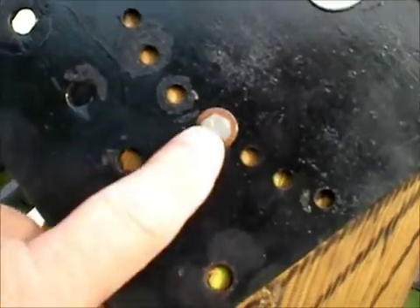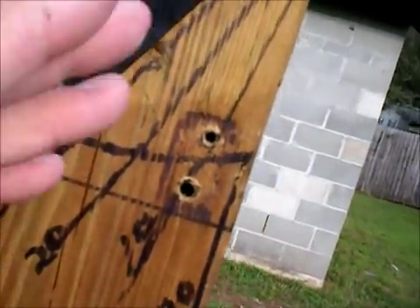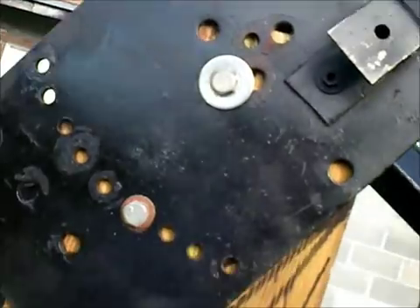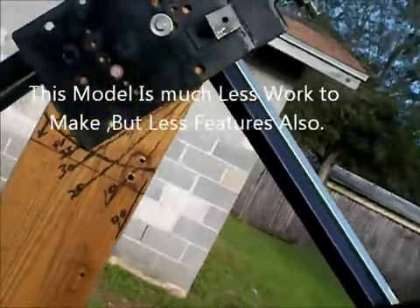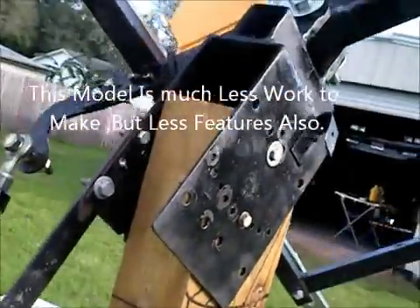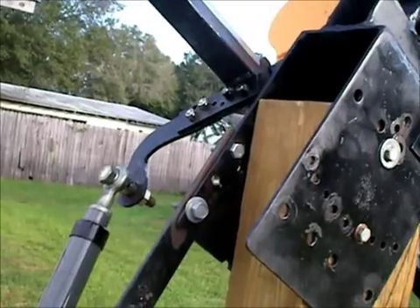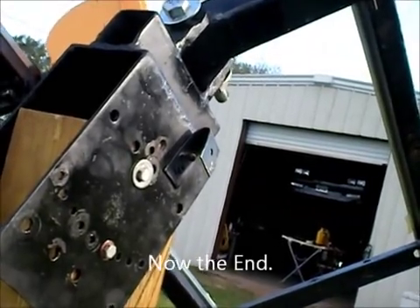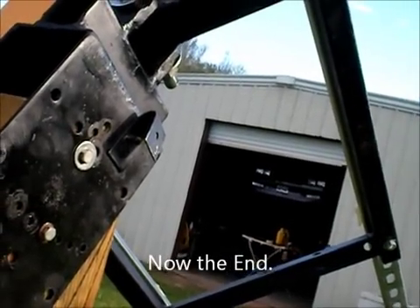To adjust the inclination you take these bolts out. I started playing around with putting lines in — 30 degrees, 20 degrees, 15, 0, and so on — for your seasonal inclination changes. I'm glad I didn't just stick this in a garage and forget about it, because I think I'm going to make a new and improved version, a bit wider on the pivot. It's a very easy way to get someone tracking their solar panels — at least three to six hundred watts of panels. This would do easily, giving you about 600 watts of tracking.